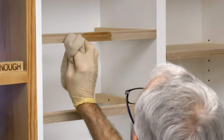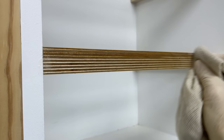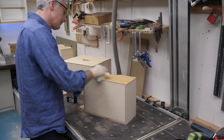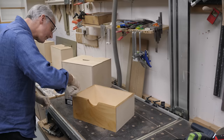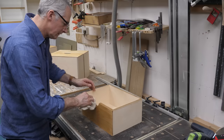While the dust settles on the drawers I'll put a little wax on the edges of the runners and then move on to the boxes - fingers crossed, hopefully they'll fit. Onto the boxes: a nice layer of beeswax applied to the face and edges with a stuffed cloth. These are just workshop storage so I'm not precious about them, but feel free to apply many layers to your own if you choose. A couple of hours later the beeswax can be buffed up with a dry cloth, all ready for fitting.